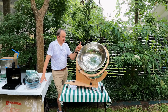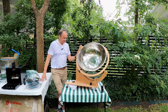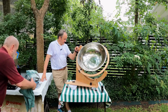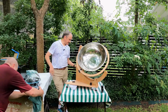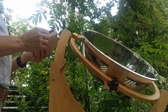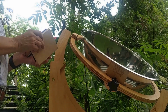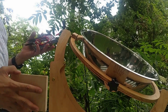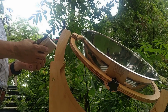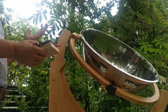So the idea of single axis, and again, maybe this is more complicated than a south running one, but I thought if it were single axis, what would happen? So I put a little motor here, and what I'd really like to do is get this to be a mechanism like this. This is a single solar panel. Mount this on here, and if I could get everything working right, then you could do it. Stan does his with little PVs. I was using light dependent resistors in this case.